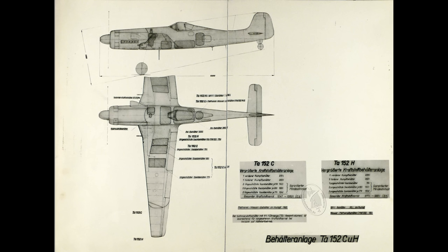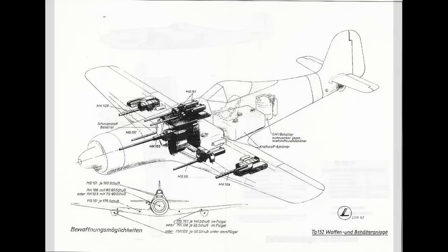This is what we would now call a nitrous oxide system. Here's the idea. If we could simply spray 100% oxygen into the engine, we could then add the proper amount of fuel and add power. And in fact, this has been done. But outside of a laboratory, it's totally impractical, which is why it hasn't been done in a production airplane. There are two main problems. There are more than two, but I'm covering these two. The first one is storage. This is easy to understand.